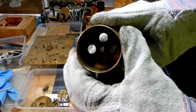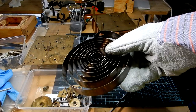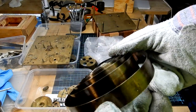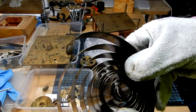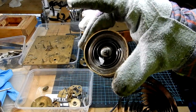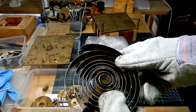That barrel seems to be alright — that's one out of three. There's our spring, oily and crappy. So we'll clean that up, grease it, put it in a plastic bag, put it aside. Then I'll do the same to this one, and then we'll be able to move on to cleaning in the ultrasonic cleaner.